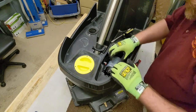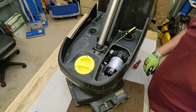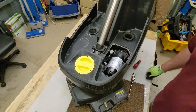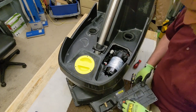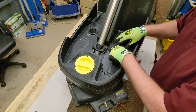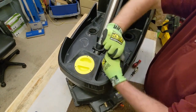Okay, yeah, there we go, it falls down. And if, oh shoot, see the wiring's got to be down inside there. On the top. I'm going to get down in there. Okay, so when we put the plate on, it's not supposed to fit flush, but if it's bowed up really bad, it means this still isn't sitting right. Hey, look at this. We have 3 screws left, which is exactly what we need. We still have to put on our nut for that pressure switch there. Yep, so it'll move a little bit, but if it's bowing up a little bit too much, then you'll need to reset that water pump so that the feet are in the correct position.